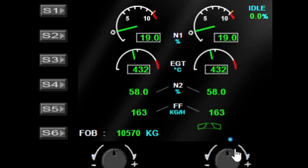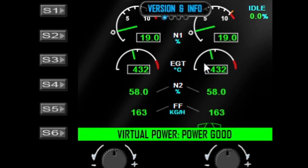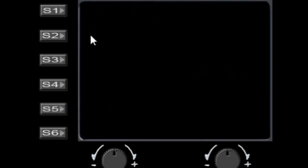The little blue mini menu LEDs on the bottom right hand side of the gauge indicate that the right dial activates the menu. Spin the dial and the first menu item comes up — the virtual power good message — which indicates we're getting decent voltage. If the gauge just shows the border, it means the gauge is powered down and not detecting enough voltage. I've increased the minimum voltage to 31 volts, which the aircraft can't output, so the gauge goes blank.